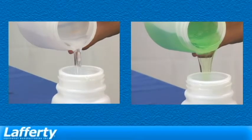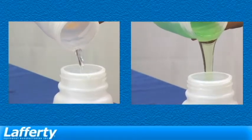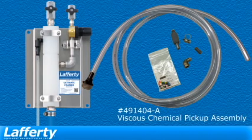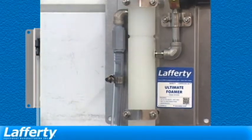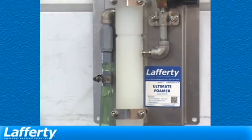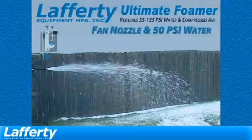On rare occasions, the chemical product to be used is too thick to use even when no metering tip is installed. In this case, you can trade out the standard pickup tube with a 491-404-A viscous chemical pickup assembly with half-inch tube, which has an even larger orifice to allow the chemical to correctly blend with water and compressed air. Feel free to request the 491-404-A when ordering any foamer and we will be happy to install it for you.